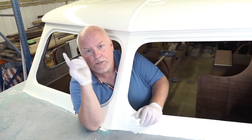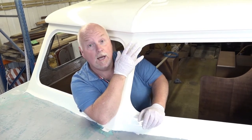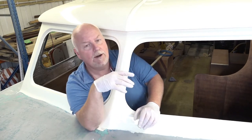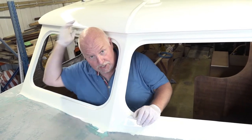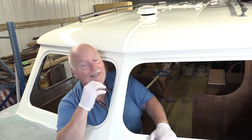It's Monday, so Friday of last week was the last point when I did the final bit of painting. So it's hard enough now for me to flat it off with wet and dry in a very, very fine paper. I need to go to an auto shop and get some 1200, 1600, or 1800 grade, just to take the nibs off the paint and see whether I can get some of these brush strokes out. Once we've got rid of that, I can then use some G3 compound — like an auto paste — with my body mop and then buff it all up and hopefully get a really nice finish.